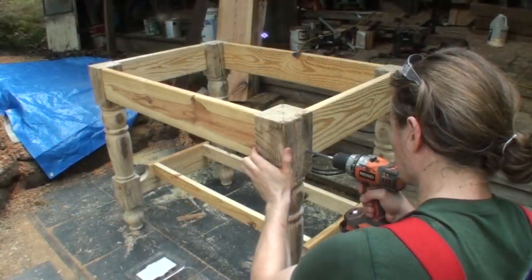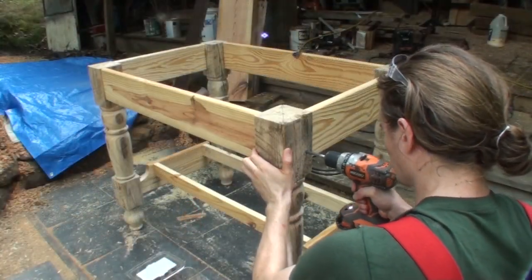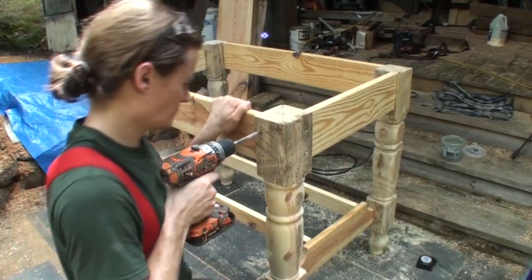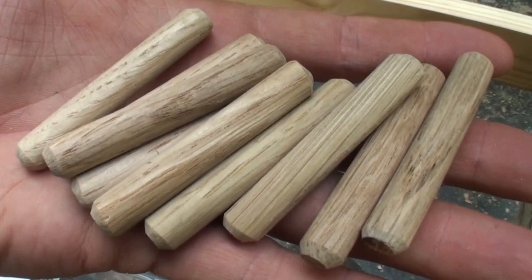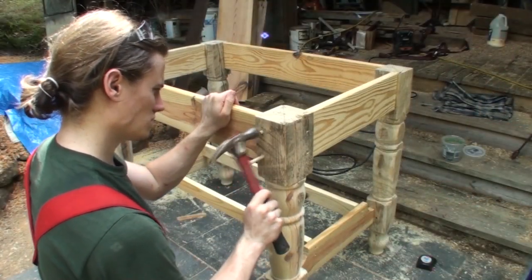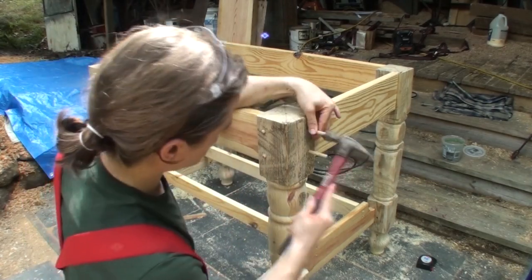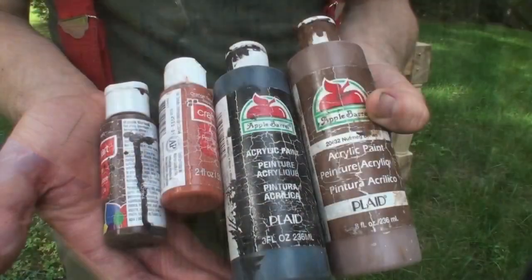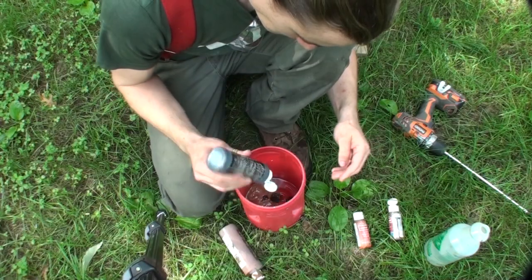Next I'm using some little cherry plugs that I cut using a plug cutter, then tapping those in with a little glue. Using a three-eighths inch brad point bit I'm drilling holes through the legs through the tenons, and then pegging them with oak dowels. I sand chamfers into either side of these dowels — that helps them slide into the hole and gives a rounded appearance on the outside, which keeps them from splitting when I'm hammering them in.